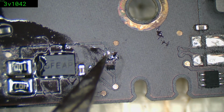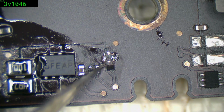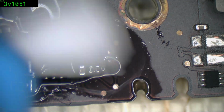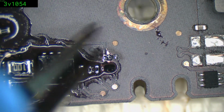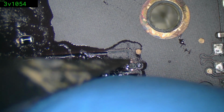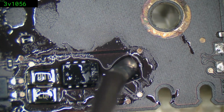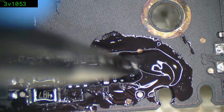This is a little more awkward than I wanted. I probably should have just run a wire. Hey, I've already committed to this option, so I guess I better at least give it a whirl. What I can do is I'll just put some green goo over it, and the green goo will provide the insulation that I need to avoid a potentially catastrophic flashover. Yeah, I'm kind of overstating things a little bit much. I mean, you've got to realise that this already, at the 0201 size, has extremely close tolerances anyway. I mean, you're talking 0.5 millimeter between the two sides.